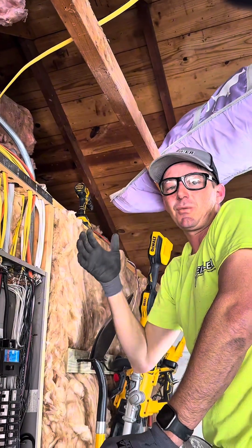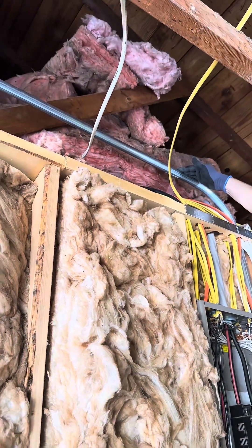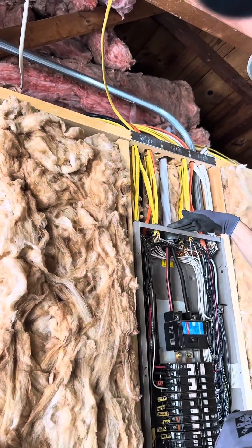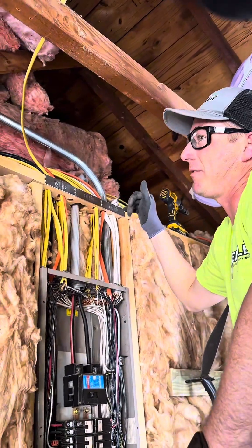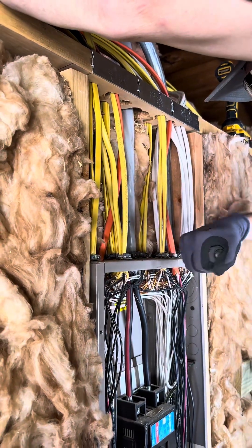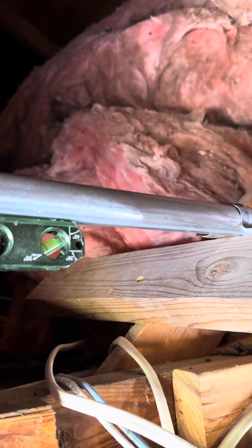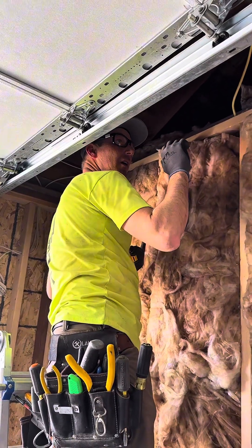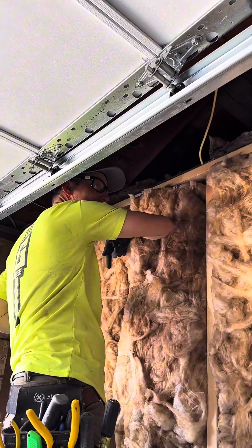You heard me say that the deduction was eight inches for the 90. What that means is the top of this conduit right here, where I measured to, is 22 inches from here to the top of this panel. This 90 takes up eight inches, which is well above average distance. The conduit is only 10 feet long, so I'm making sure that one stick — one 10-foot stick — will get me from there all the way down at least into the wall.